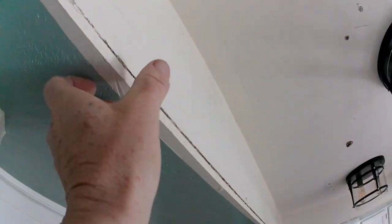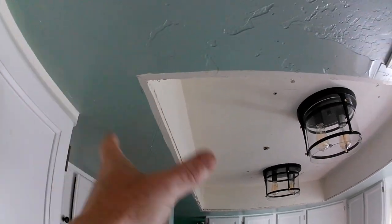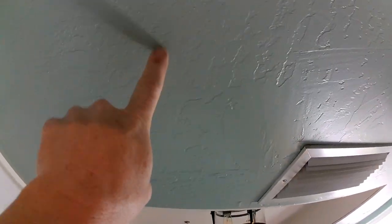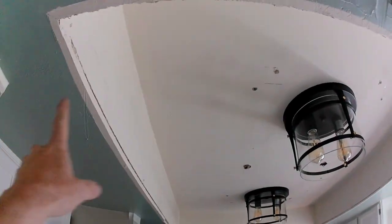Raw sheetrock. You could even do like a 90 degree piece of wood, wood trim it, but on here we're gonna corner bead it, mud it, coat it, and then match this texture. This texture in here is like a Santa Fe skip, and here's smooth, so we gotta texture everything in the box the same as this. So let's get to work.